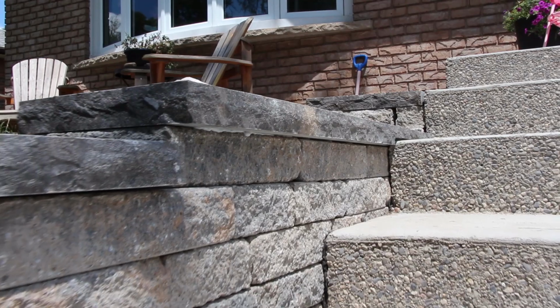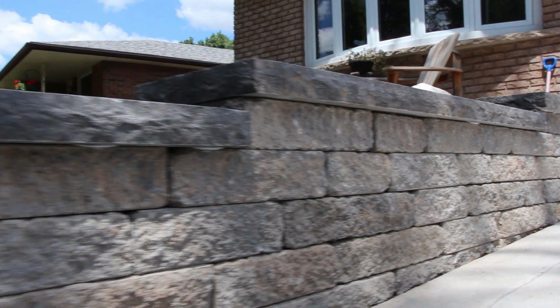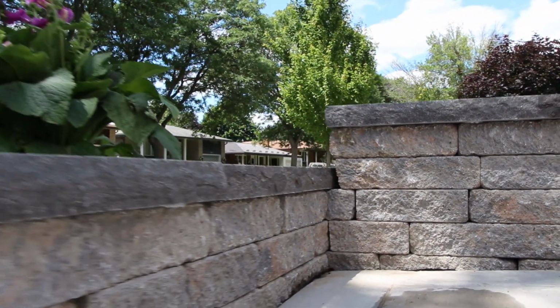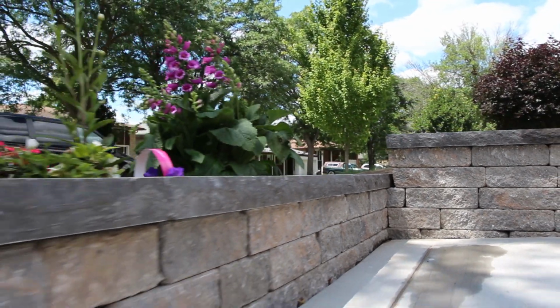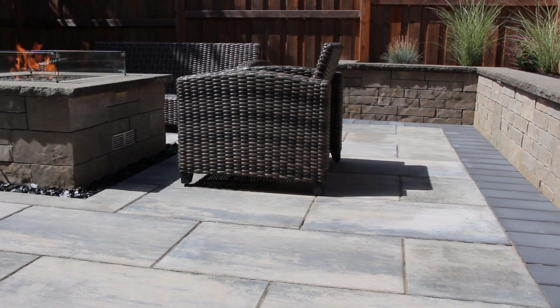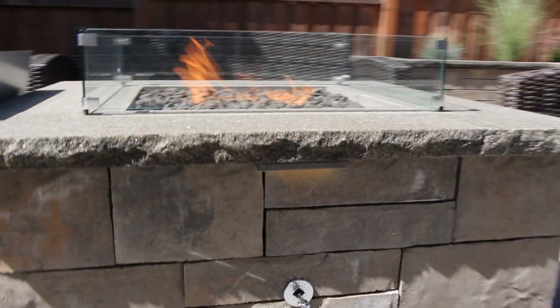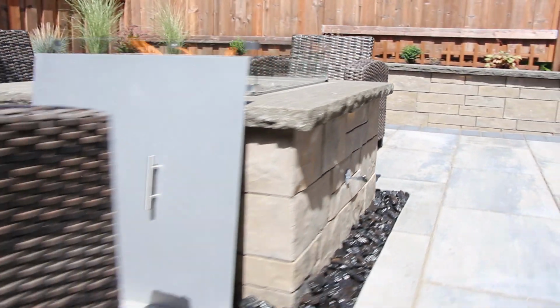Additionally, when planning caps for a retaining wall, for a seat wall, whatever that might be, I'm going to look at the most efficient use of my caps. Typically, we're only using 4-foot natural stone caps in these applications. So I'm going to plan this out with my wall. What looks most aesthetically pleasing, whether we're going to do just a 90-degree corner or if we're going to miter that corner, but also what works best to have the least amount of waste on that project, as well as to reduce the number of slivers in that project.